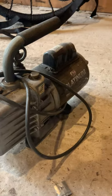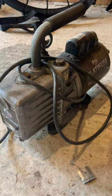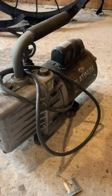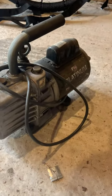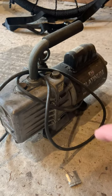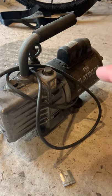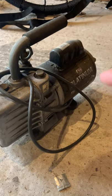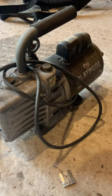The reason why I'm talking about these vacuum pumps is because I've been reading up on A2L refrigerants and A3 refrigerants, and you have to be mindful that when you service those types of refrigerants, your vacuum pumps, recovery equipment, and all your tools have to be rated for usage with those refrigerants. So be mindful when you're transferring to different types of refrigerants, especially Carrier people with R454B here in 2023 — make sure you've got the right gear to do the job.